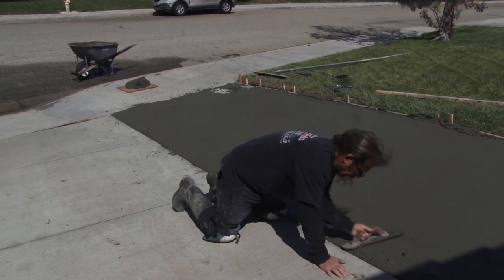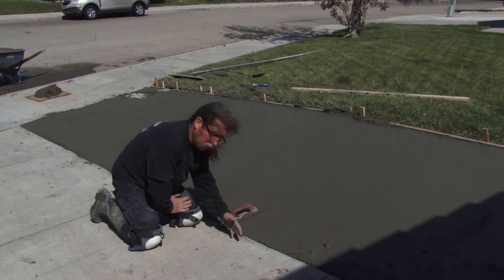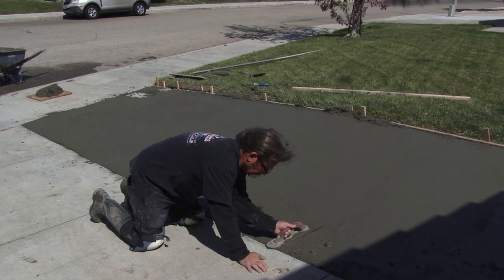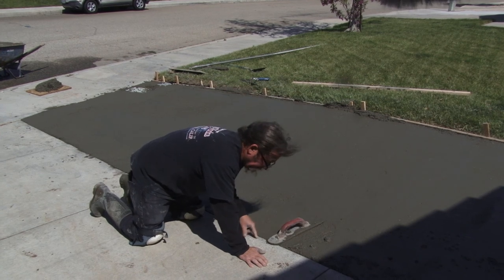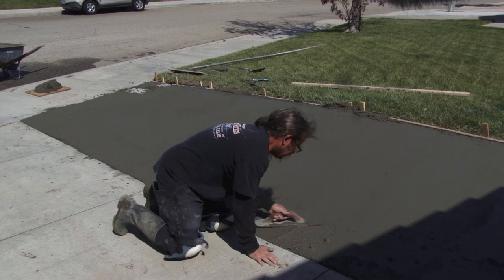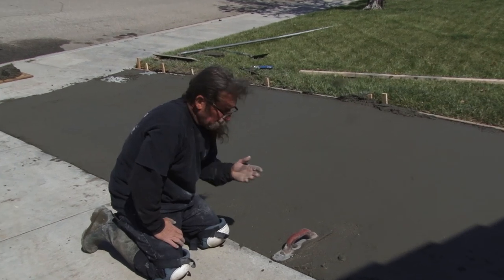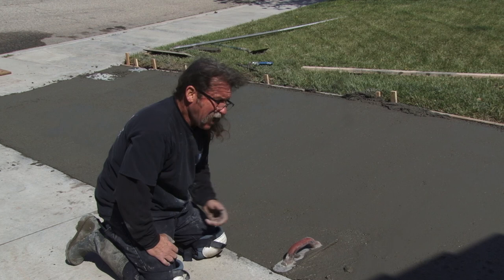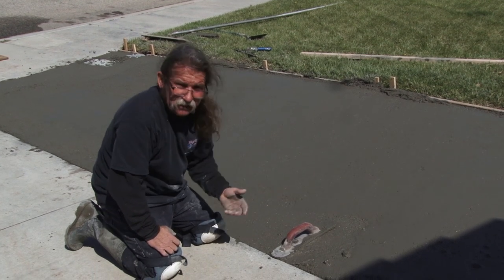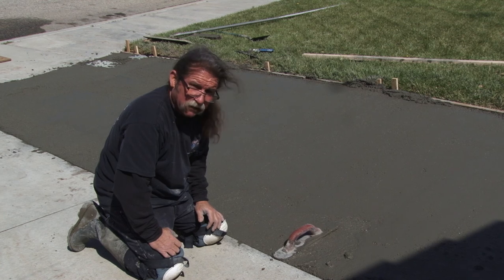What we're doing now is just floating the edge. We want to not get a bunch of mud on the driveway — that's more mess to clean up later. I'm just making sure the top of the float is just touching the top of the existing concrete and that I'm not pushing down. This isn't rocket science. Concrete finishing is physically challenging. Usually it's lack of knowledge or just outright stupidity. I've worked for some really good guys and some guys that quite frankly don't need to be in this business.